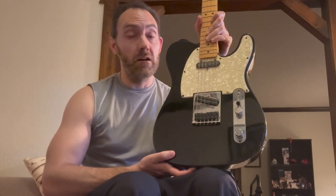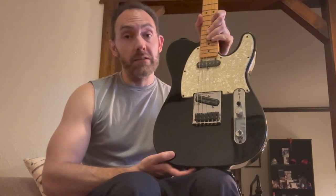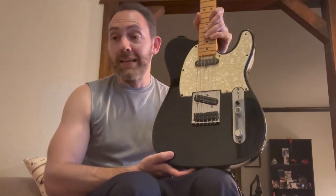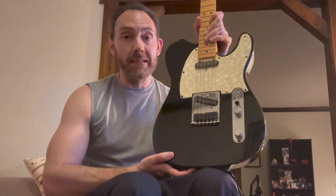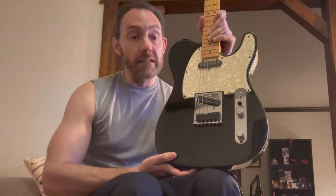And we are back. Before I reveal the results of the blind test, I wanted to say that all those sound samples were mic'd with an SM57, and the EQs were set to about noon on both amps. I was not trying to optimize them for each guitar. I was trying to give a fair basis of comparison. Also, it should be noted all of these guitars have 250K pots. This one had a 250K pot stock. I put that pickup in before I knew the difference between 250K and 500K over 20 years ago. And though there are new pots since then, they were 250K as well to maintain the sound I was used to. So that is equal among the three guitars.